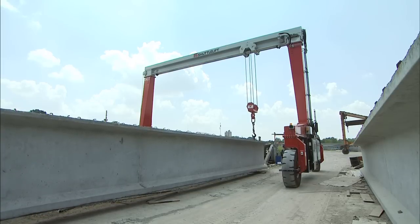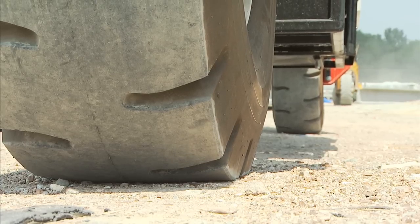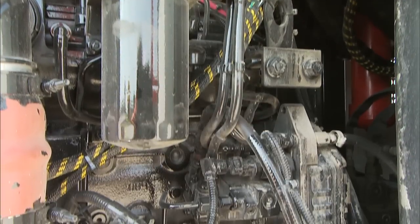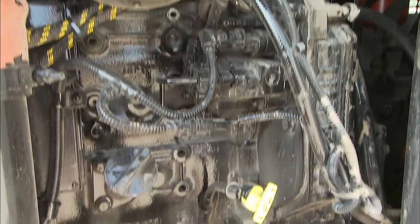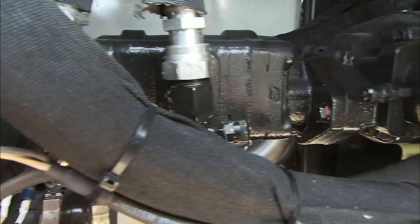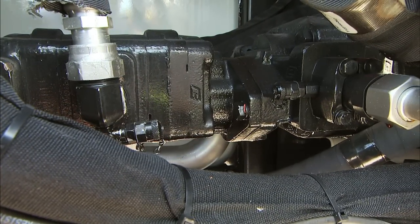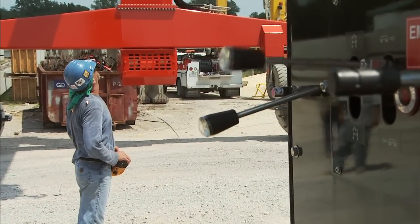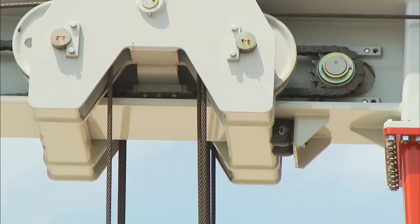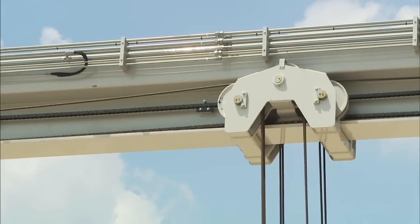Every machine is built on a cantilever wheel frame to make changing a tire as easy as removing the tire on your automobile. The ground bearing pressure for the crane is roughly the same whether the crane is empty or loaded, due to the tire squatting under load and increasing the machine's footprint size. All power units are tier three diesel engines, and the crane function power system is diesel over hydraulic — the diesel engine drives a series of pumps which provide oil to the function valves and on to the actuation motors and cylinders for each operational function.